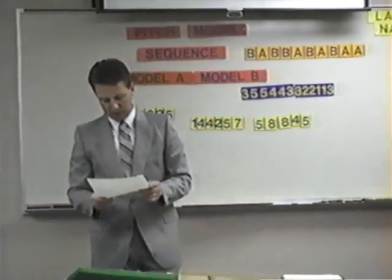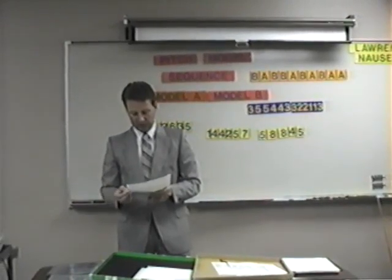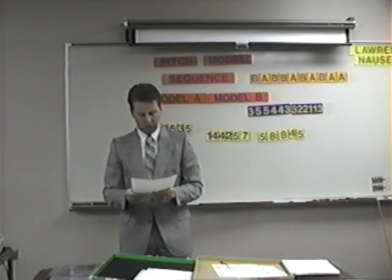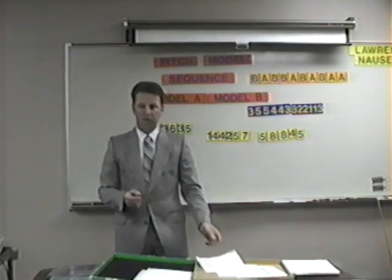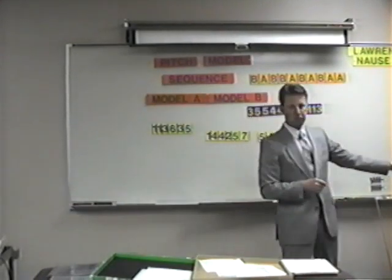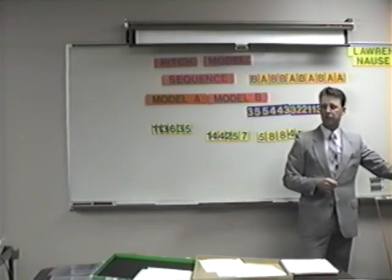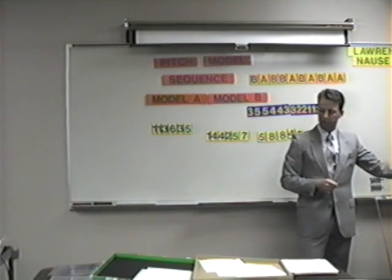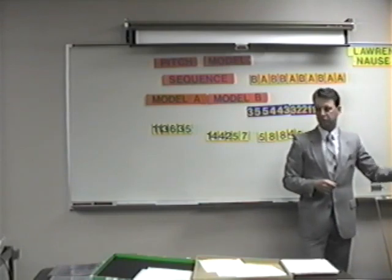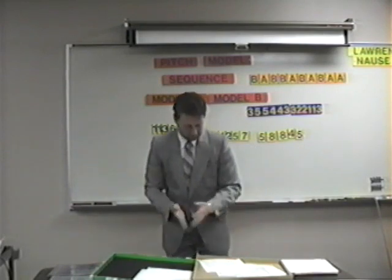They said, in this size design, we produced this tire: Sebring All Season, Kelly Springfield Navigator, Canadian Tire Season Master, Canadian Tire Season Master Mark II, the Monarch Steel, and the Dunlop Gold Cup. So what they had was a mold which was generic, and they took screws out of the sidewall plates in the mold and removed the sidewall plate and put the name Dunlop in and screwed it in and made several thousand tires. Then they took it out, put the Canadian Tire sidewall plate in. So they used the same mold to make tires for six or so different companies.